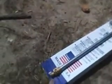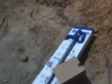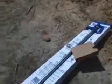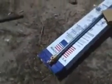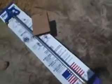The actual valve is down here at the bottom. When you open up the thing on top, the water will fill the tube up, come out the top as you'd expect, and then when it's turned off, the valve opens on the bottom and it will drain back out. So when you're not using this hydrant, the tube is actually empty, and that's how it's frost-proof. The valve, of course, is below grade, and it's going to be far enough down that's way beyond the frost line around here in Georgia, so that's going to be pretty good.